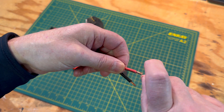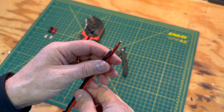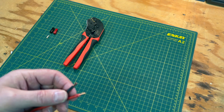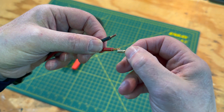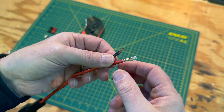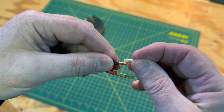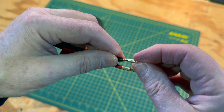It's a good idea to give the wires a twist so that the strands will all be inside the pins when you install them. Then slide the pins over the wires, making sure that all of the strands are inside. An easy way to remember the correct way to install these is red on the right with the pin pointing down.